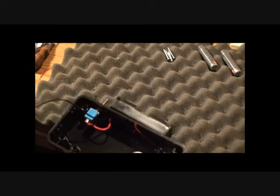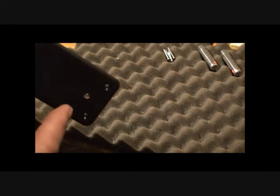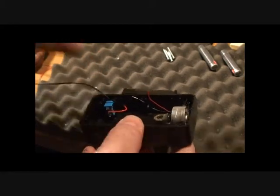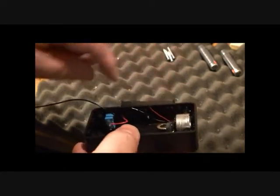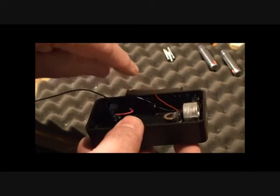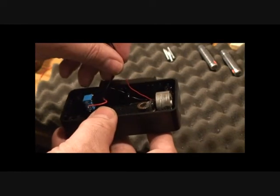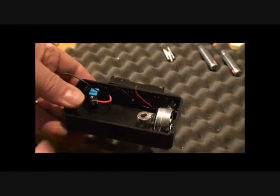You can put the LED pretty much anywhere. Just make sure that if you're running a AA or AAA rig like this — three volts — you get an LED rated for three volts, otherwise it will burn up. To wire it: the red lead from the battery goes to the center post of the switch; the red lead from the motor goes to one of the outside posts. Your ground just goes straight to ground. If you want an LED, take an additional lead from that outside post to the positive lead of the LED. I'll wire this up and be right back.